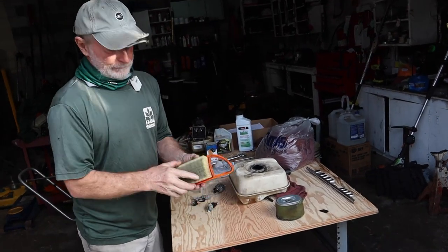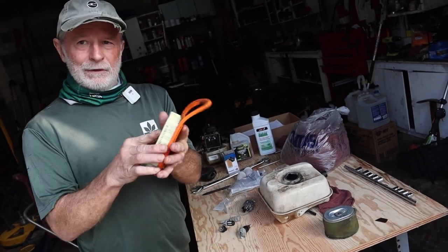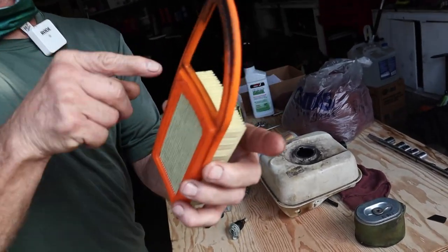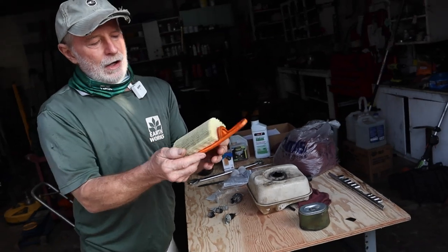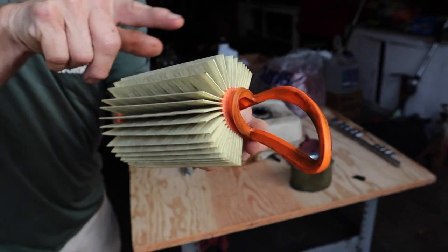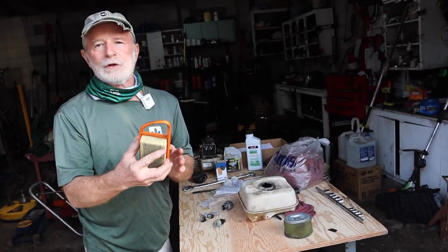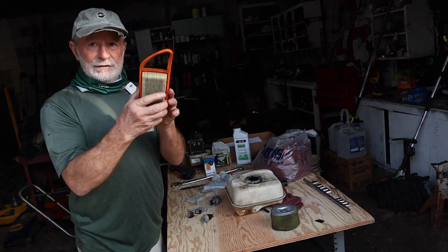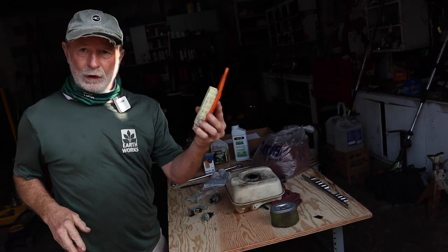Cleaning your air filters is important. They're meant to pass air one way and are built in layers. When you want to blow one out, blow it in the reverse direction from which the air came in. If you can't get it all out that way, you can open it up and blow it sideways. If you think you can't get it clean, take this ten-cent item and throw it away rather than risk your million-dollar apparatus not working right.